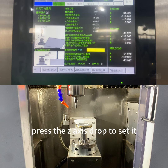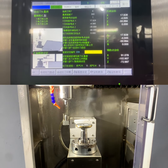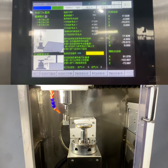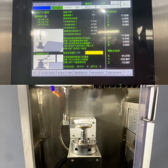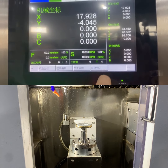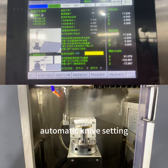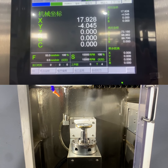After selecting here, press the z-axis drop to set it. Later, when you only need to change the tool, just come back and change the knife number here for automatic tool setting. The z-axis coordinates will not change for the other tools. Thank you.